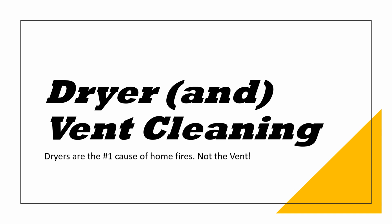You need three things for a fire. You need material, lint. You're going to need something to ignite the lint, like a heater or a flame if you have gas. And the last thing you're going to need for the good fire is oxygen. And that's going to come from your vent.